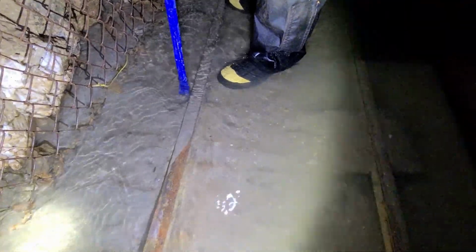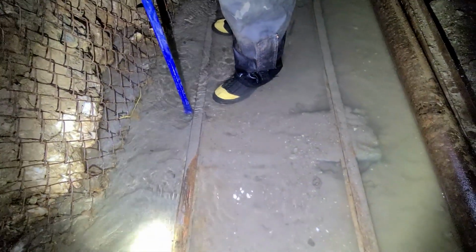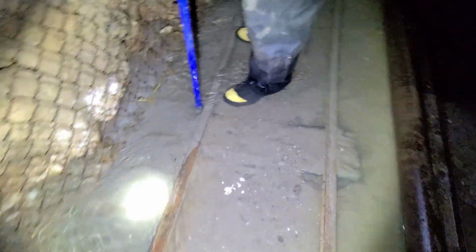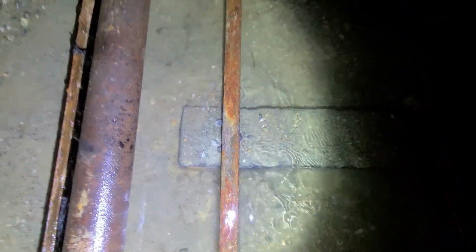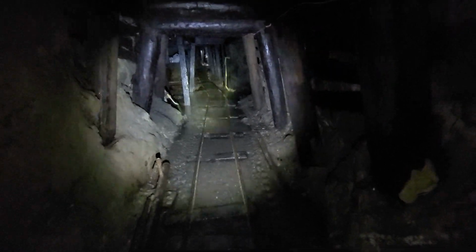and another one of us has to jam a bunch of silt and rock and gravel underneath the tie to elevate it a bit. Also, because it's been decades or longer since any work has been done back here, a lot of the spikes have come out of the rotten wood, and so we're also pounding in spikes. I just pounded in these spikes here, which will hopefully get it through at least another few decades. So we started back there and have made it this far.